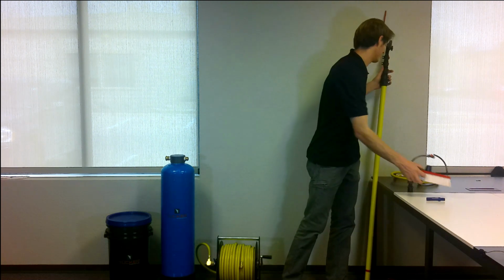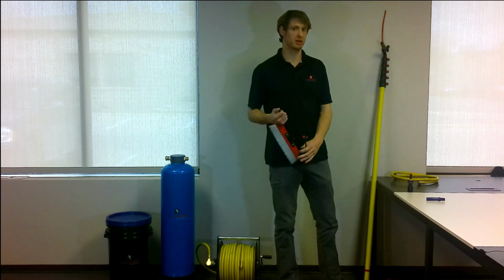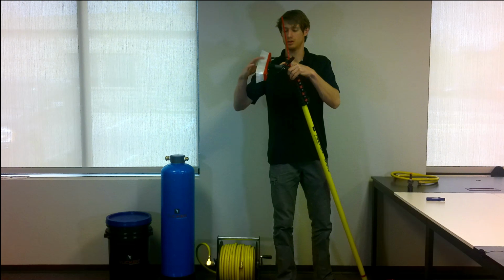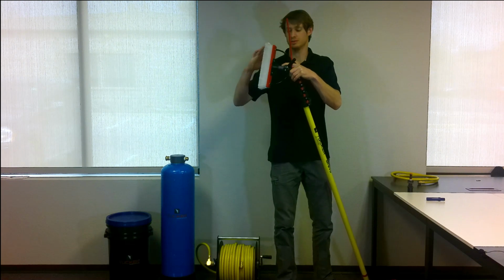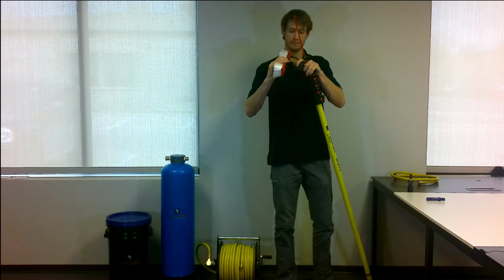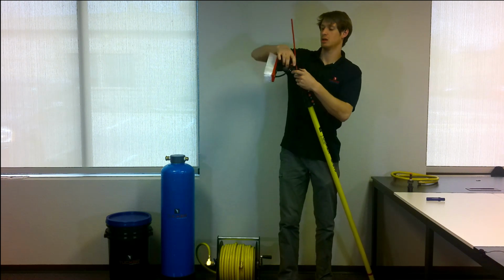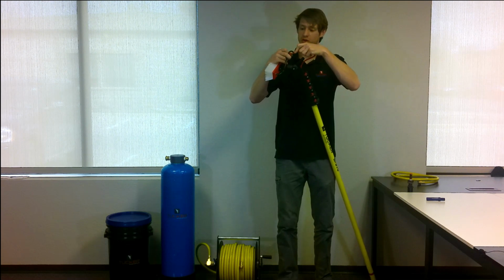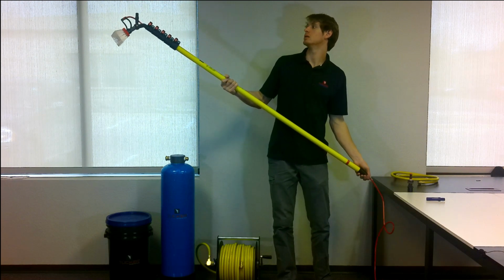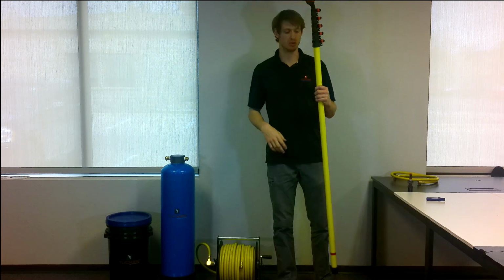After that, I'm going to grab my dual trim nylon brush. Make sure these 2 hose sections to the jets are disconnected. And on the Euro thread of the gooseneck, I'm going to insert my brush. I'm going to tighten my brush until it is firm, not rotating left to right, but also not over tight. Once that's done, I'm going to connect the 2 hoses to the jets with the extra tail of hose I got from the 100 feet. I'm going to insert it into the push to fit. I'm going to pull the slack out from the bottom. Now I have this brush ready for use.